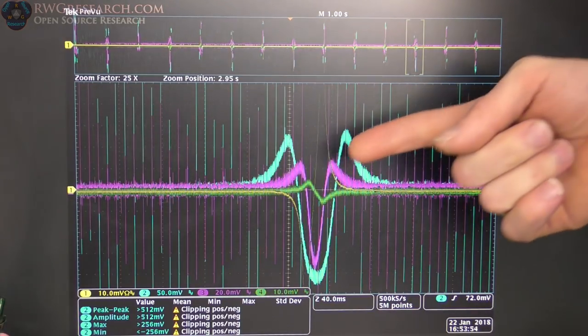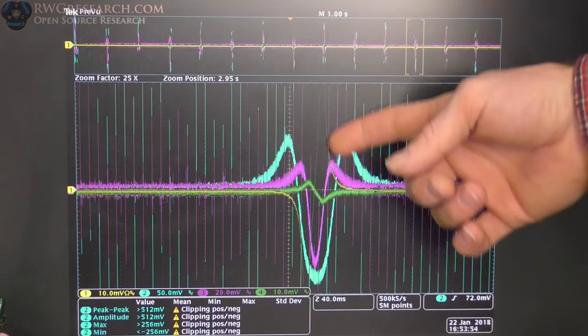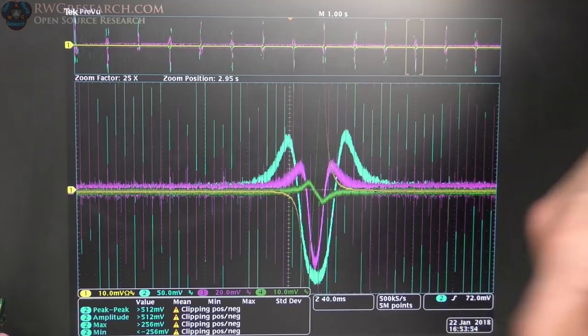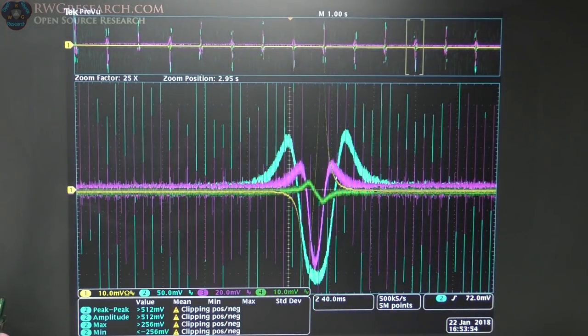Why is that? Don't forget the yellow trace, and it's kind of hard to see here, but the yellow trace goes down, up, and back down. This is the exact opposite of what we were seeing when the magnet was facing one direction, but it's the exact same as what the coil was showing when it was flipped the other way. You really need to sit down and look at the tests and look at the results, because these are basic fundamental things that Faraday was trying to discover in his time, but he didn't have this kind of equipment to do it. And now we do, and we get to see very clearly the results